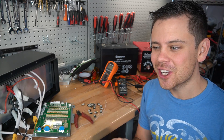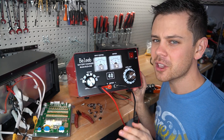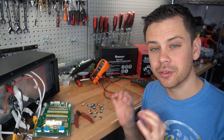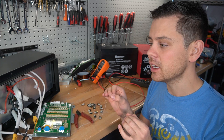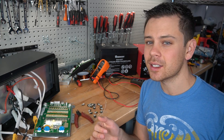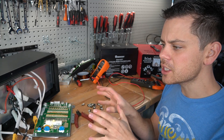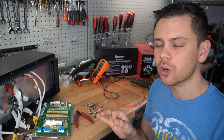The lesson is: do not use cheap junky chargers. If you disagree with me, please let me know below. This battery performed flawlessly for the first capacity test, and I had to change the settings to ensure that the self-heating pads were on before the second test. Everything was working fine. The time of failure is when this battery was connected to that charger — at no other time did anything fail; everything else worked flawlessly.